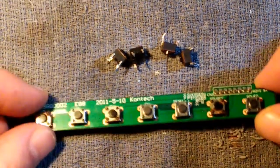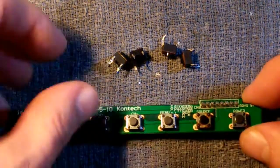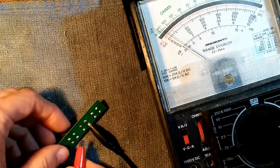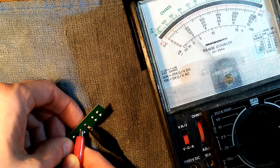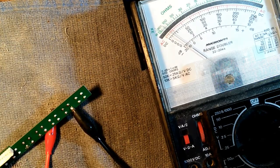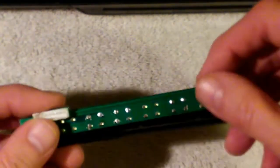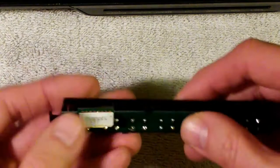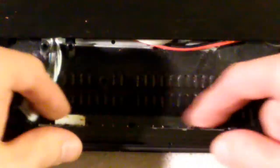I've finished soldering in the new ones. You can see the difference — the new ones are shiny and these are the old ones with rust on them. We'll check all the switches like this before we go ahead and reinsert this circuit board back into the TV. Now we're going to put the button board back into its little housing. Get it so those teeth are covering it first and it should just pop right in. Then put the button board back into the TV, snap it under those little snaps, and put our two screws back in.